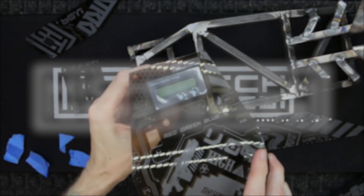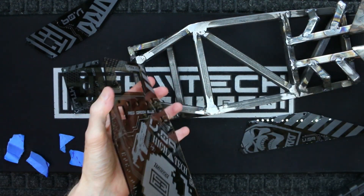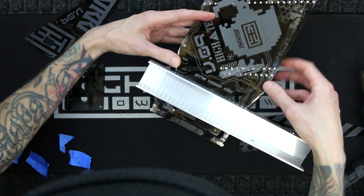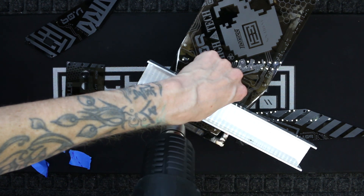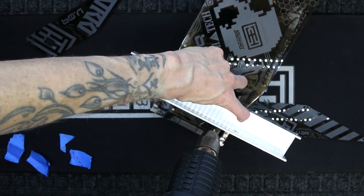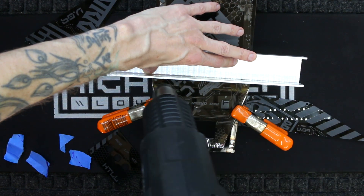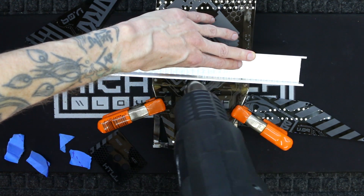Last time I was rushing a bit and I made a mistake with the measurements of this little battery meter, but I managed to trim that out so it actually fits in the panel now. With all the panels cut out, all I have to do is conform and bend them around to the shape of the frame. I'm taking a bit of time at this part because if you put too much heat into the plastic it starts getting really melty, and since I really don't want to redo all these panels I'd rather go slower. Using these little clamps helped a lot.